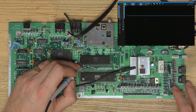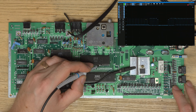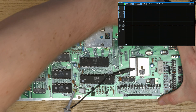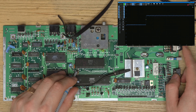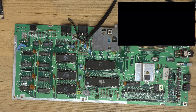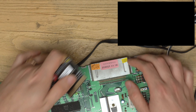Here's one from one of my machines - clearly written 'U2' on it. I normally take a working Commodore, swap chips, run the tests, and once I know they're okay I write on them so I can be assured it's a working chip. Let's pop this in. Clip the oscilloscope back on, turn the console on and probe again - yes, there we go! The ready signal is now running, that wasn't running before. The address line that was bad is now running too. The previously faulty pins seem to be running.